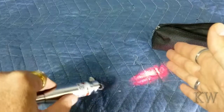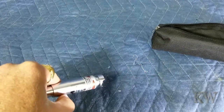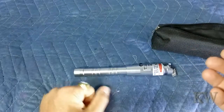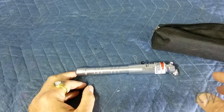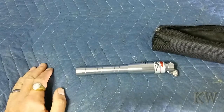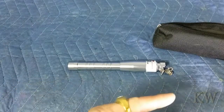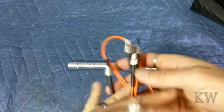It has two modes: on and blink — there you go, it's blinking. What you can do is, if you've got two of these and the fiber has two strands, you can put a solid light on one and a blinking light on the other and go to the far end. A lot of times you're out there by yourself and have to go 3,000, 4,000, 5,000, or 6,000 feet away to see the other end, so it's nice to have an indicator without having to walk back and forth multiple times.